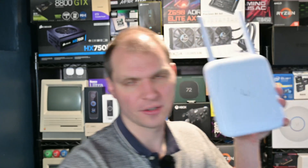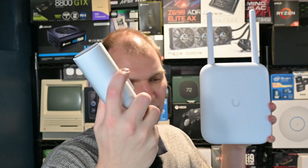The shed has a couple of cameras, so the setup is: my garage and then on my shed was the U6 Mesh that died — now this U7 Outdoor replaces it. It uplinks to the other U7 Outdoor on the garage, and from there it handles all the cameras around the shed — a G5 Pro and a G4 Instant. I'm basically walking Wi-Fi down my property to get coverage and keep cameras running.